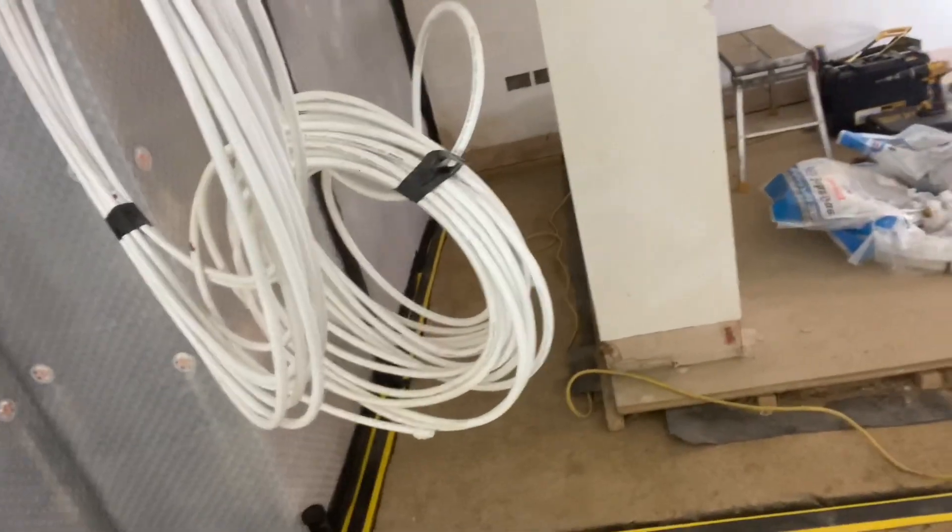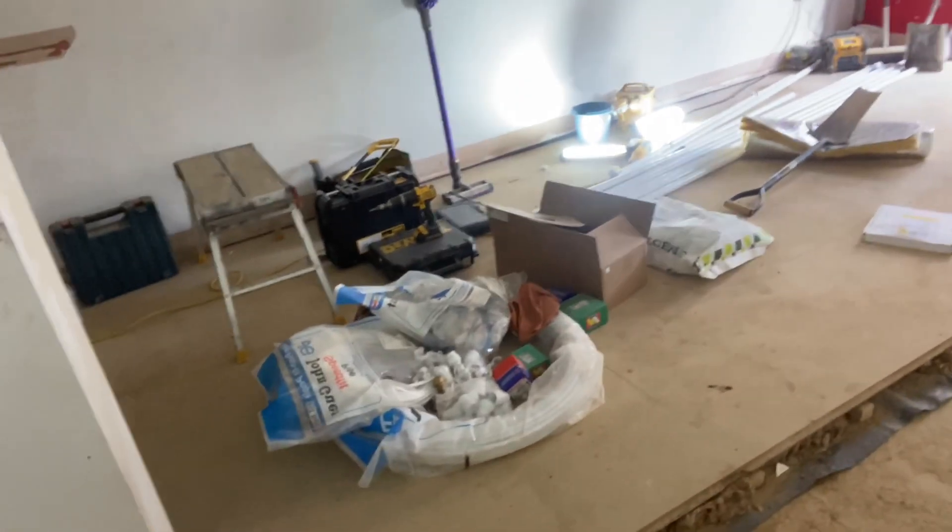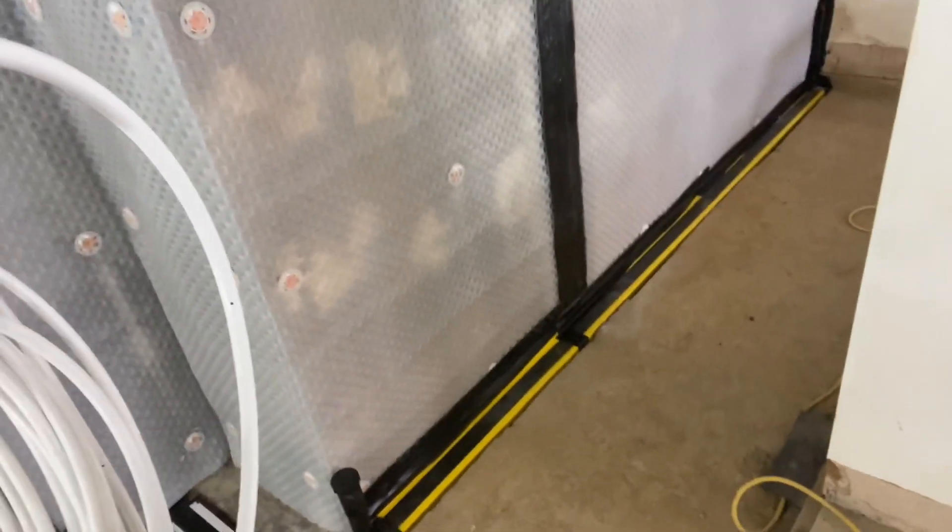Just the way I've designed it. The floor is going to be made back up on that side with timber. Then I'm going to screed this. I'm going to put some Natsem — that's why we've taped up at the top — on top of that and screed it just so that it's solid.